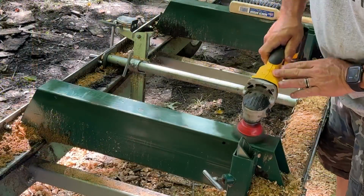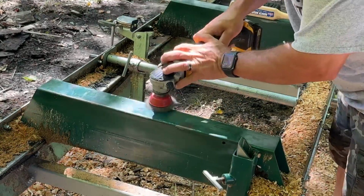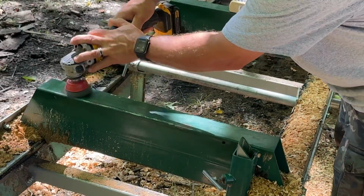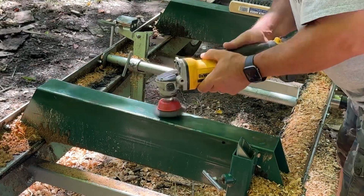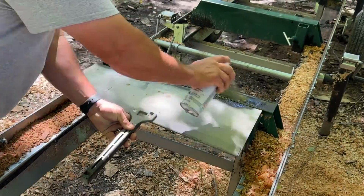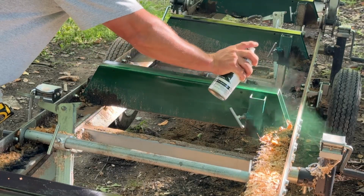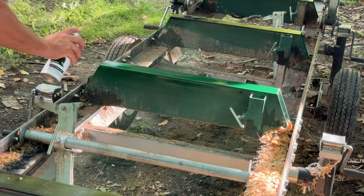Okay, so let me show you how these are put on. Well, the first step started a few days ago when I knew these were coming. I reground down with a wire wheel down to bare metal where the chips had occurred. So for the first coat, I used a coat of black Rust-Oleum. It's what I had on hand at the time. Then I went out, got some hunter green, covered it up. It's a pretty close match. Not exact, but close.